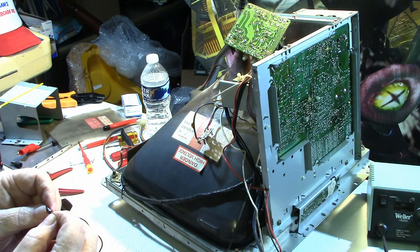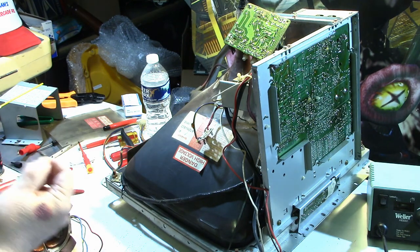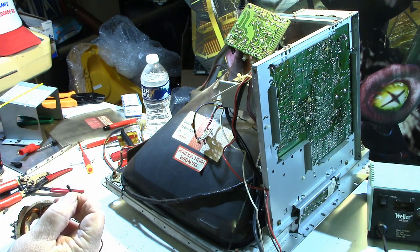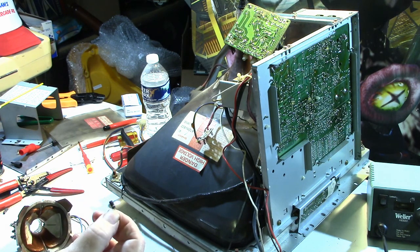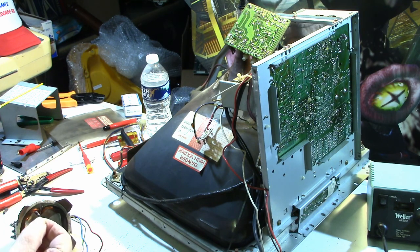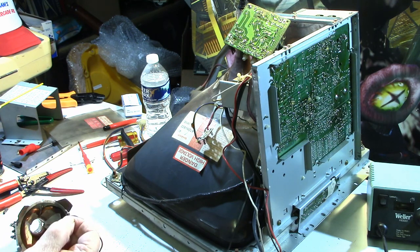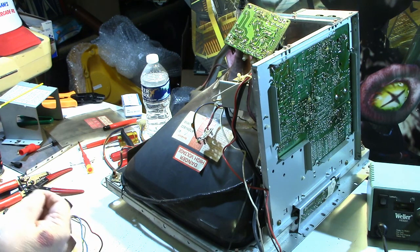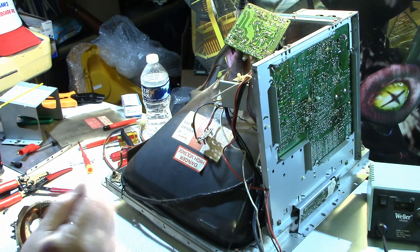But anyway, I tried to get a reading of what was left, and I only come up with something somewhere in the 6.2 k ohm reading, somewhere in that area. Nowhere near what the color code says it is. But if, instead of violet, that's blue, gray, red, that's 6.8 K. So that could be close. So now I don't know what this resistor is. If anybody knows what the value of this is and what the function of this is, I'd like to know.